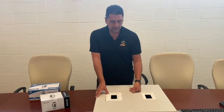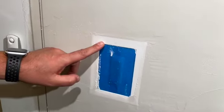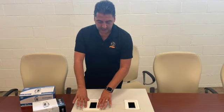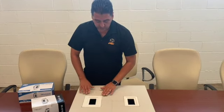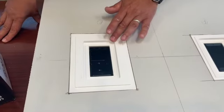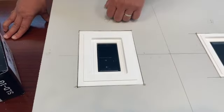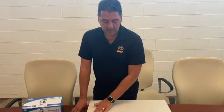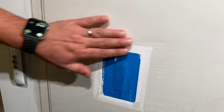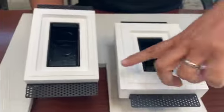Once you level and sand it down, you're able to paint or texture it the way you want. The center is already pre-finished, so all you have to do is simply paint it. When installing the product, it's nice to put some blue tape to protect the inside since it's already level-five finished — there's no need to go on the inside. When mudding and painting, it's always recommended to work around the perimeter and protect the center as much as possible, because if you puncture it it's harder to get it perfectly level. Keep the inside taped until it's ready for paint.